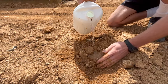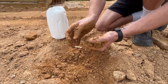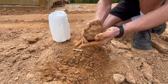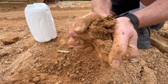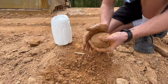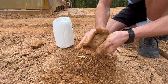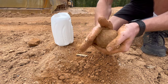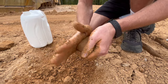I add some water and begin shaping the soil in my hands. This soil is very sticky, full of coarse and fine aggregate, and holds its shape very well, which is a great indication of what we refer to as a ready mix. You can actually hear that this mix is sticky and full of coarse aggregate as I squeeze through it. A perfect cob mix will have roughly 50% coarse sand, 25% fine sand, and 25% clay. We refer to this as a ready mix because you don't have to amend the soil with extra clay or sand — basically this soil is perfect for building a cob house, and all that would need to be added is water and straw.